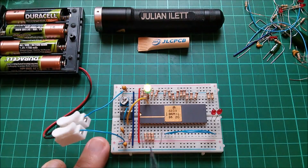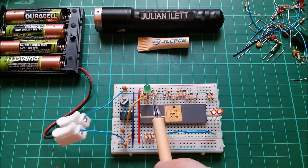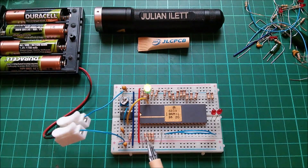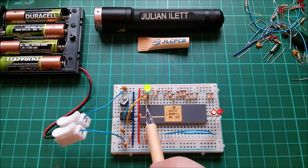I've got pull-ups and pull-downs, which are mostly 1Ks, although I did the data lines in 10Ks. The 1Ks are sitting on things like interrupt inputs, which are active low, so I'm pulling them mostly high. A couple of things have to be pulled low. The clock input - this is an interesting one.